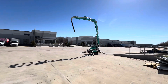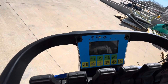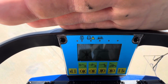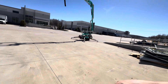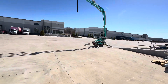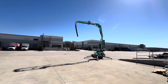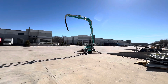There's an indicator on the panel that shows when it's in that position. I just got into position and if you can see there, there are three dots along the boom. Right now because I have it in the position, all three dots are filled. If I were to raise this section, that dot will go empty. So the three dots have to be filled — that indicates it's in the position where it can be moved with the boom in this shape and with the outriggers lifted.